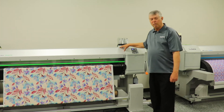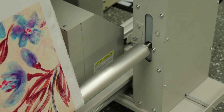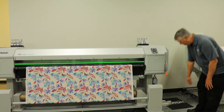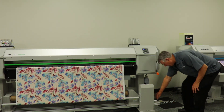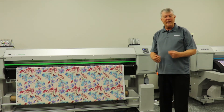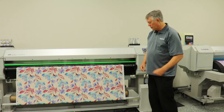One of the things that makes this a unique printer is our fabric handling system. It's been designed and adapted over 12 years of R&D from various systems, and it's a very easy system to adjust and maintain. To adjust the tension front and back, it uses a system very similar to what the gym uses — a set of clips that allows you to adjust the tension front and back. Adjusting the tension front and back allows you to run a wide variety of fabrics, weights, and fabric types. It'll handle everything including a two-way stretch in the print direction, though it will not do four-way stretches.